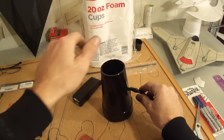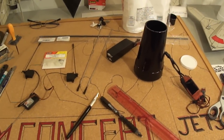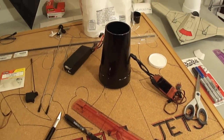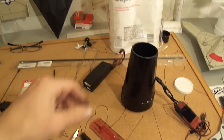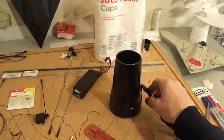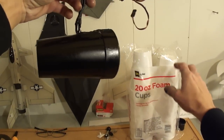I use the same thrust system on all my 70mm jets. I'll show you later how I make it for the 64mm, but I'd just step right into the 70mm paired with that LiPo battery and speed controller — you've got a powerful little system. You'd get about five to six minutes of flight time on this whole system, which ain't too bad. There you've got your 70mm EDF unit placed inside your thrust tube made out of a dollar store foam cup.